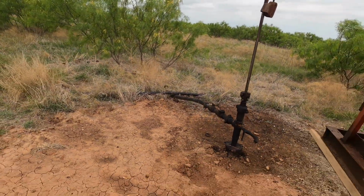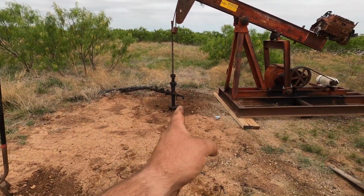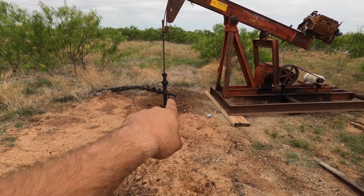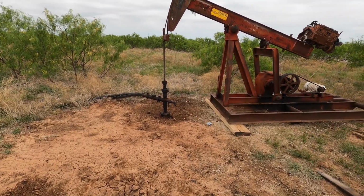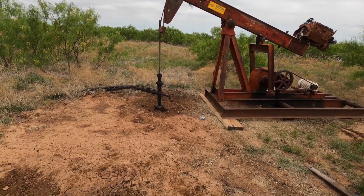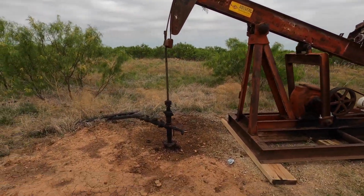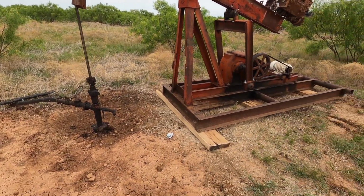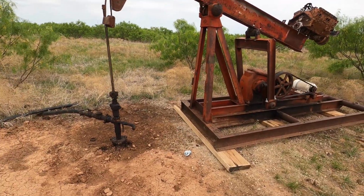The other thing is this still looks kind of bent to me. The hole that's in the ground is straight, this looks like it's going uphill. I think it might have kinked the tubing slightly there at the wellhead. And if that's the case, at later times after this is pulled again, when that's fixed, it'll be lined up. Being an inch out is not a huge deal. Also, if it's too far out, it's easy to come out here with a pickup or a truck or something, tie a chain onto it and bump it forward just a little bit.